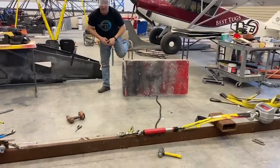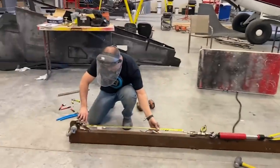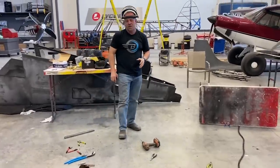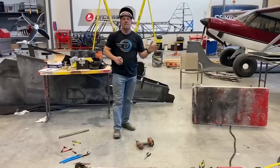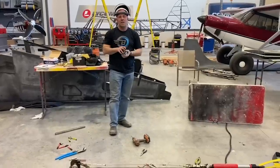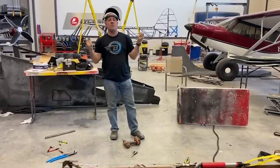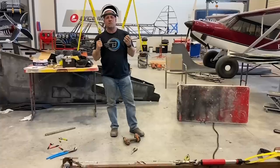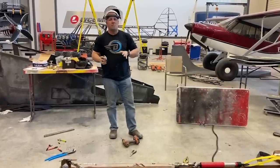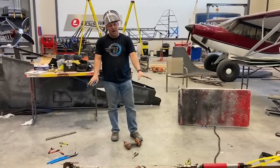Let's see if it returns. All right, it returned all but about a 16th of an inch. We're still a 16th long. So I'm gonna call that a failed part. Though it's still structurally strong, what that means is that it's stretched to that point, it's not returning to its original location, that thing would be loose and kind of vibrating in the wind. But I'm gonna call that ultimate stopping point, non-flying, 600 pounds.